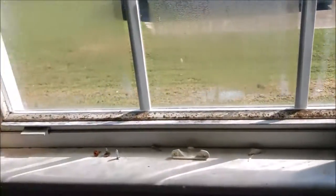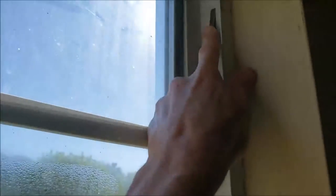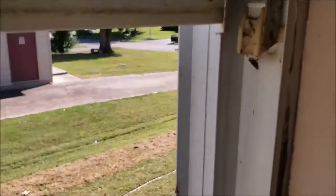This is an older rental house I'm working on. First of all, you've got these little clips here — pull those out so the balances will catch. Once they catch, the tension has been relieved off the balance — you can see the balance hanging down below.